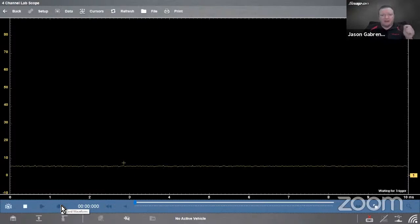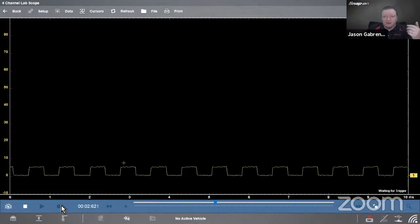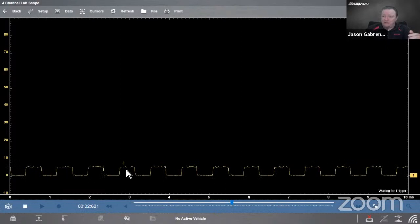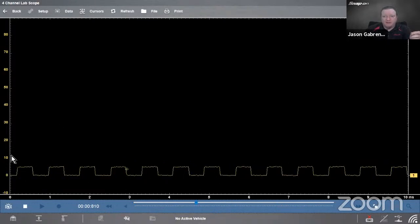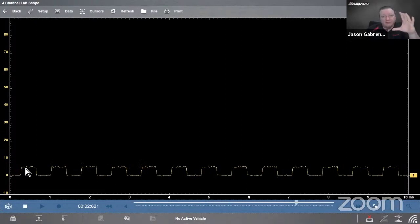Let's pull up a simple five-volt square wave pattern — a repetitive five-volt square wave on the screen. How do I know it's five volts? I look on the left-hand side at the scale and see the peak is about halfway between zero and 10, so that's roughly five volts. I'd like to change some settings on the scope to see this a little better, because right now it's a little small and hard to see what's going on. I want to make it bigger on the screen by changing my scale.